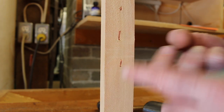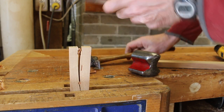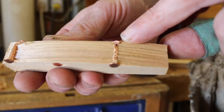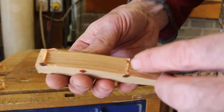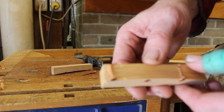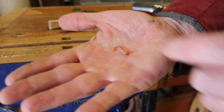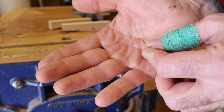There's the one we drove in without putting the iron hard against the plank. This is the one we drove all the way through and then bent flat. And this is the one that we curled over into a hook. What we're looking for is this nail hooking through into the plank — just like my finger is demonstrating. When we're done, the surface of the finger would be at the surface of the plank and this part bedded in there. That's never going to come out — that's nice and tight. This will draw the planking together whereas the other one won't do that very well. That's the basics of it. We can see the properly clenched nail versus the improperly clenched nail — the body is all starting to kind of bend to the side and we don't know what that was going to do. That could easily have bent down and split that plank open. What we don't want is this potentially punching back through the plank, and that can happen if your nail is too long.